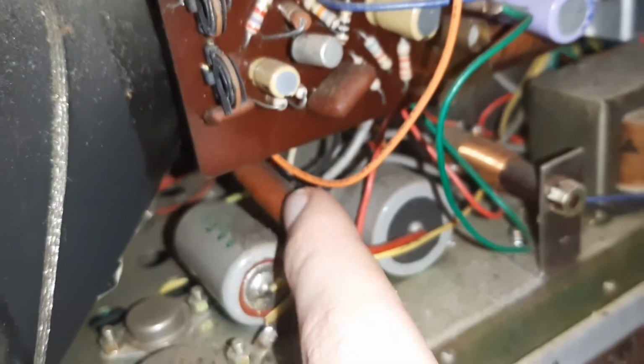That is dangerous, though. Like, how the hell am I gonna replace that? If I can, that is. How am I gonna replace that? Without a schematic, I can't. This got some Japanese paper capacitor in it. 2.2 UF. Huh. Yeah, it's got Japanese paper caps in it.